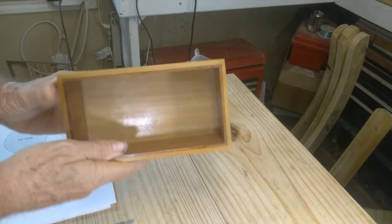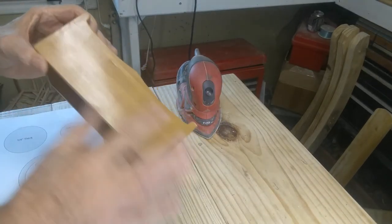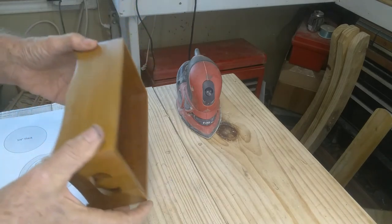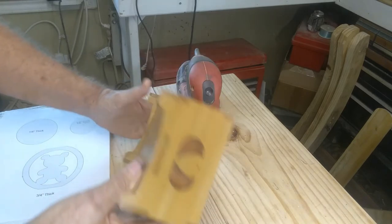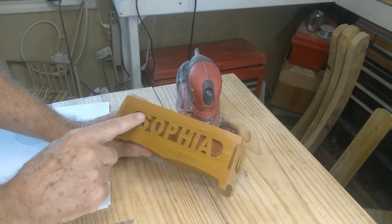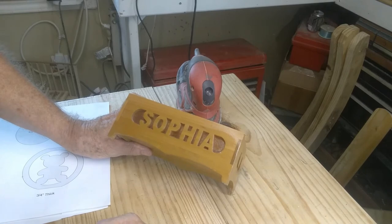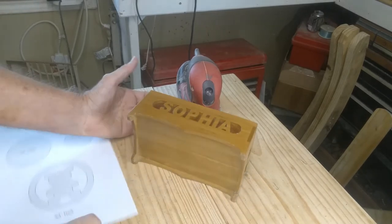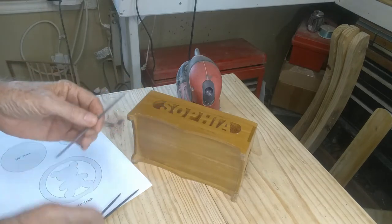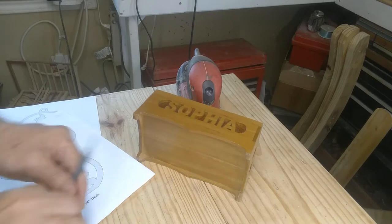When you get your stock for your project, most of the stock that you buy for a scroll saw is already sanded to 150 grit, so there's not a lot of finish sanding you need to do on a flat area. Your main work is going to be in two places: around the edges where your scroll saw will leave some fuzzies, and maybe some debris in tight spots you need to clean out. So I have a little set of jeweler's files — a flat one, a triangular one, and a round one. I use the flat one a lot. It gets the fuzzies off and cleans out debris. Those aren't necessary, they're just very helpful.